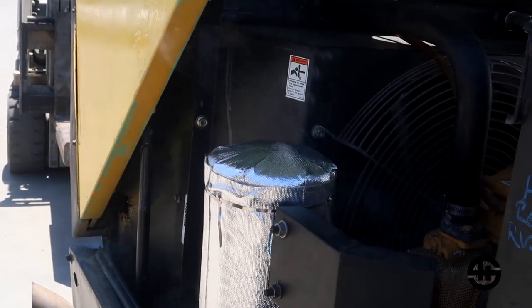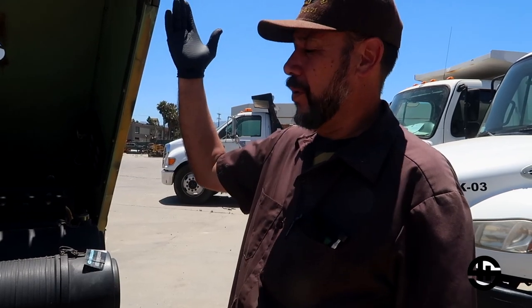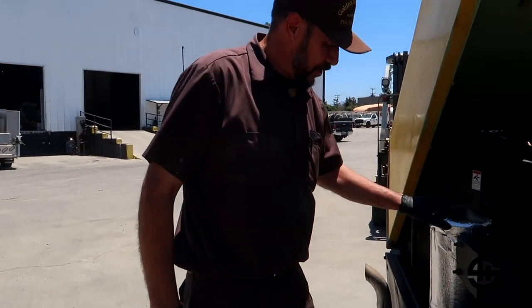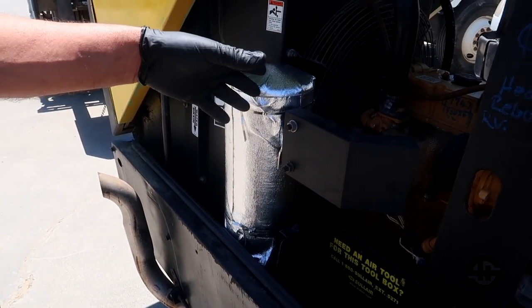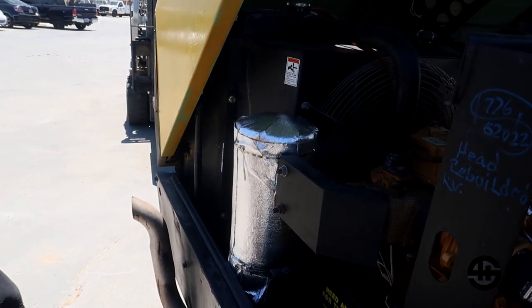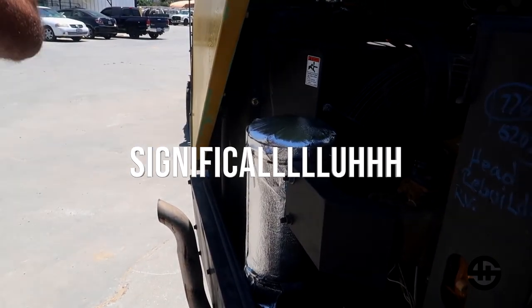That glue is finally burning off. We did make some progress; however, I'm still not fully happy with it. We're going to be able to run it with the door open so it dissipates the heat. The shield we installed worked great — it was putting 600–700 degrees of heat around this area, but now with this cover it's only 150 degrees, so it cooled off significantly.